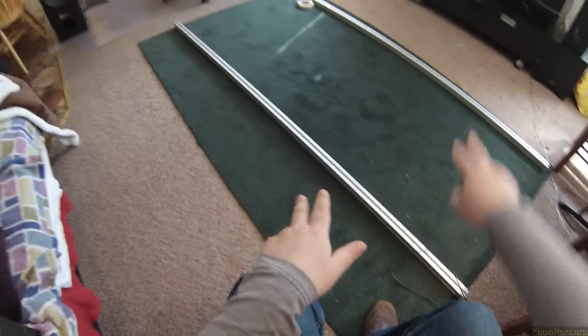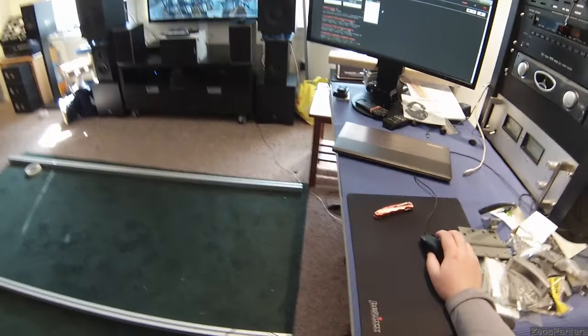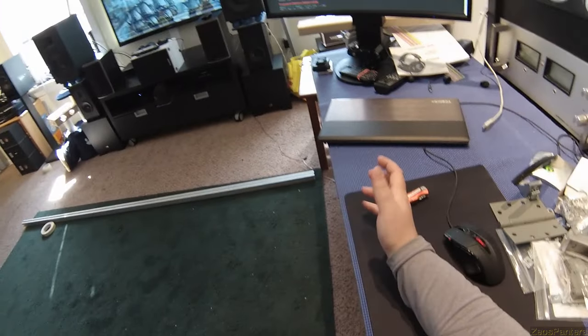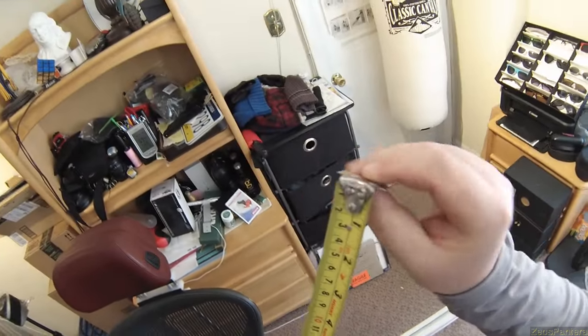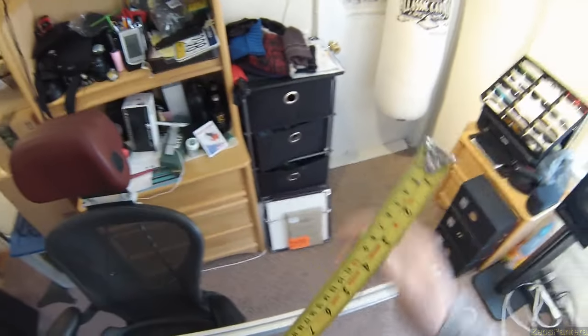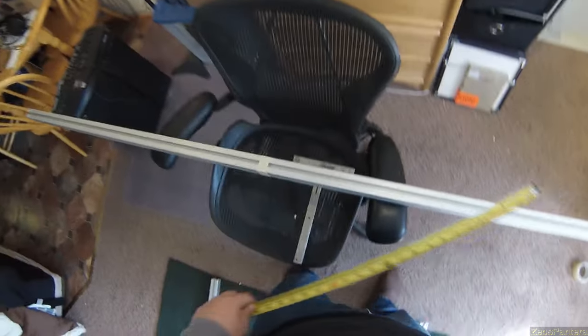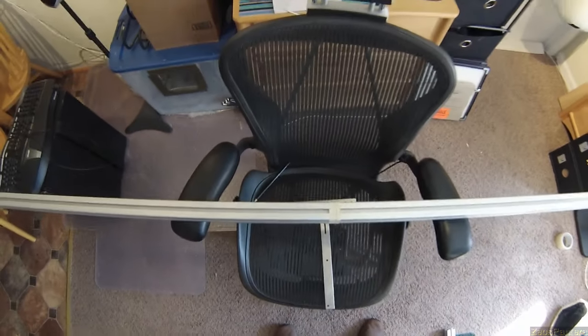And then I realized, well, I've got to take away the thickness of the two pieces, because that's 40 millimeters and that's 40 millimeters. So 1,038 minus 80 is 958 millimeters. So I came over here. I killed an inch on the end of this because, see how that moves a bit? So I started from 1 centimeter, I went 168, marked it, used my square. Rotate, rotate, rotate.